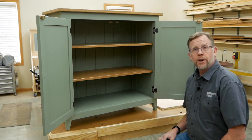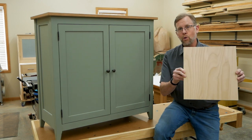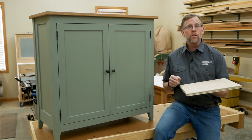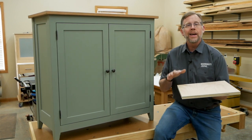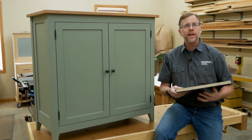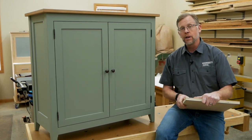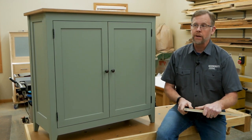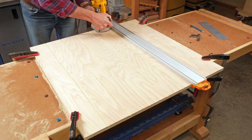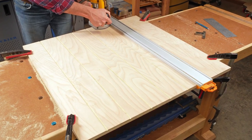I've got some plywood in here too. Both the bottom and back panels are three-quarter-inch plywood. I settled on three-quarter-inch cabinet-grade birch plywood — you can find it at any plywood dealer and at some home centers. It tends to be the least expensive hardwood plywood on the market, and it has smooth faces that take paint well. I could have used three-quarter-inch MDF here, but MDF is really heavy, and since small cabinets tend to get moved around a lot, I didn't want the extra weight. I routed V-grooves into the back panel to give it a faux slatted wood appearance and to add some visual appeal.